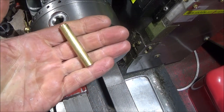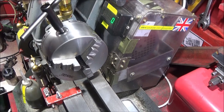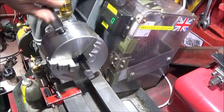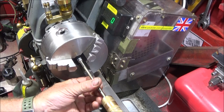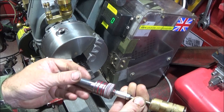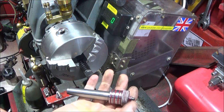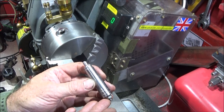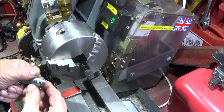That's how you do batch work with the face-off tool, the carriage stop, and the backstop — you can get a whole load exactly the same length. When finished, open up the jaws and move the tooling out of the way, screw the slide hammer onto the stud, and knock or pull the backstop out. Then you can use the shorter one — you can even make them shorter than this; that one goes right up inside the spindle.